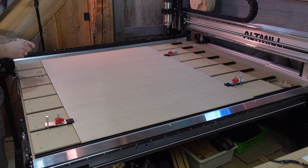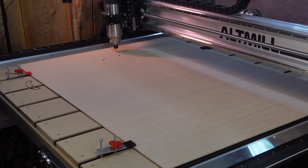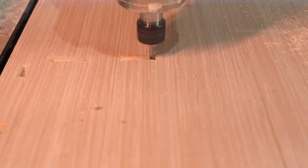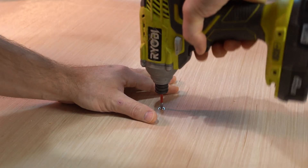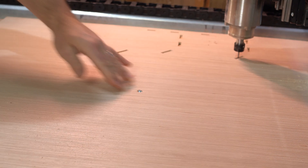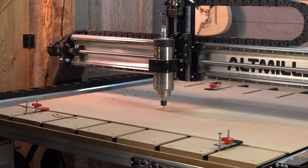...the material wasn't as rigid, or I guess as flat, or maybe my work holding was a little lacking. The material was pulling up a little bit with some of these cuts, so we decided to pause the job and drop in a couple of screws just to hold down some mid-points. We're fairly certain the bit wasn't going to cut through them, but you know — CNC roulette.